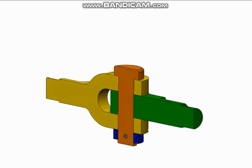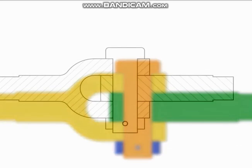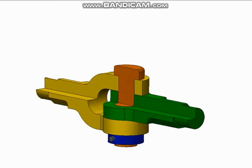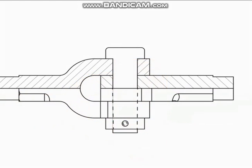Just by looking at the side view, you cannot say how it is. This is the sectional view — cut in the middle. Again here, this pin is also not shown in section though it is getting cut in the middle. This could have been shown in section. Then this is the half sectional view. Half means from the center line below it won't be shown; from the center line upward the section will be shown. That is called half sectional view.